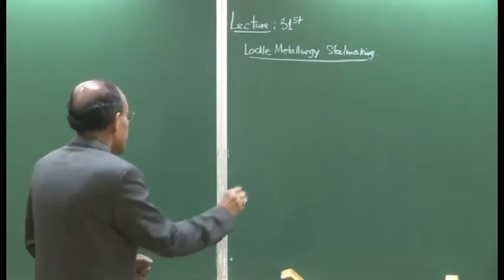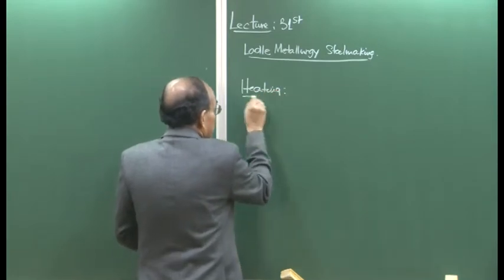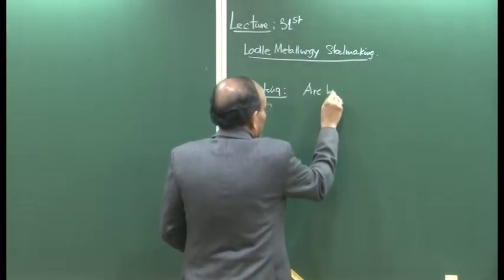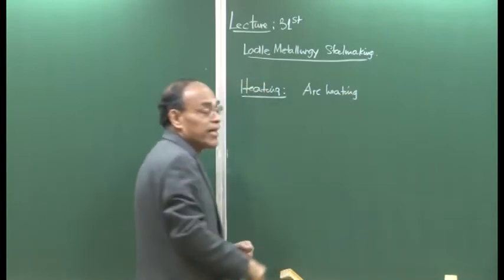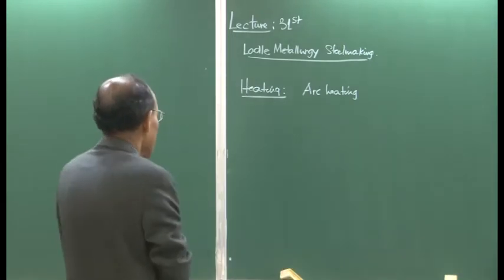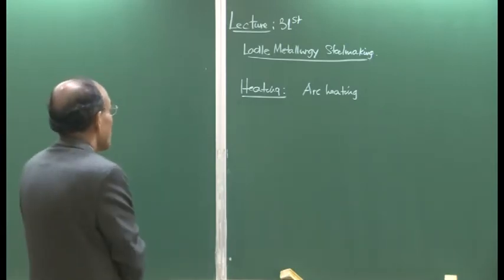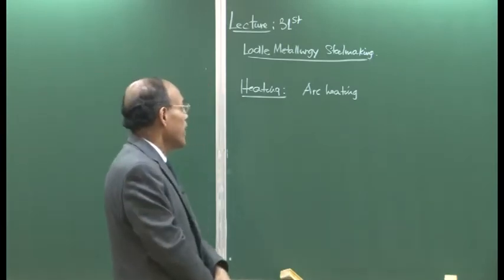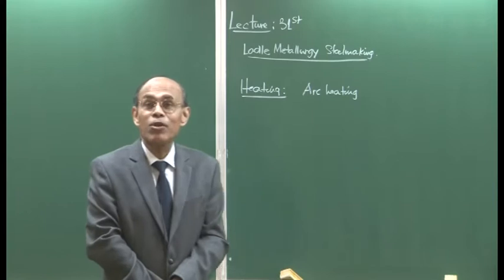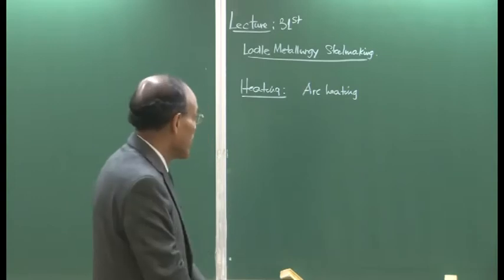Okay? So, heating is what we were talking about, and I mentioned yesterday that the heating is basically arc heating, and we will not do any chemical heating. Chemical heating is basically done by using aluminium and oxygen, the same principle as in the aluminothermic process. Aluminium oxidation releases heat and helps to elevate the temperature of molten metal, but that tends to impair steel quality because of generation of a deoxidation product like Al2O3, which contaminates steel.